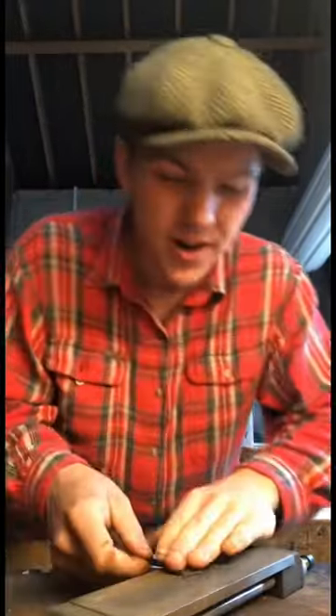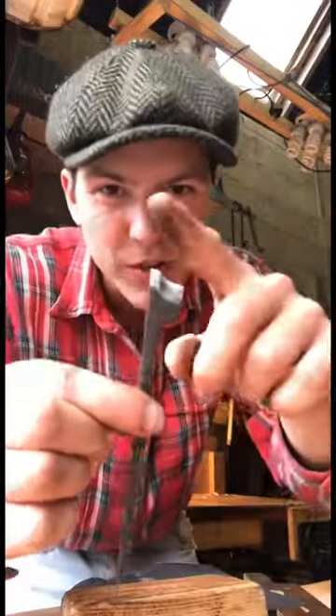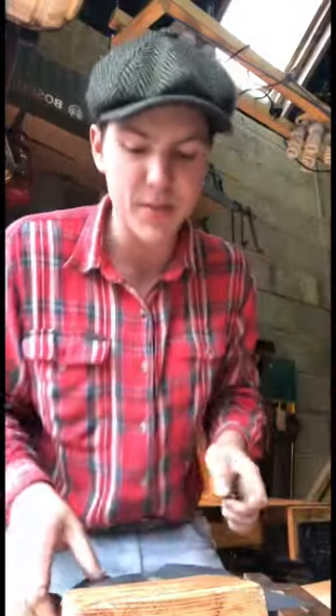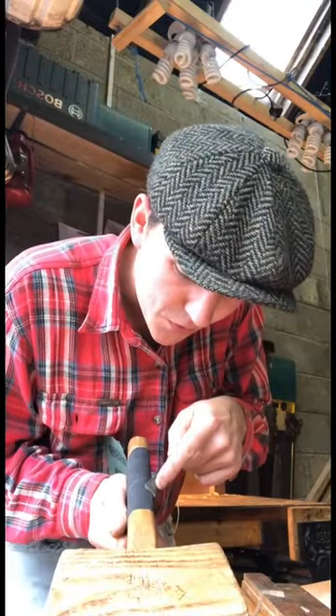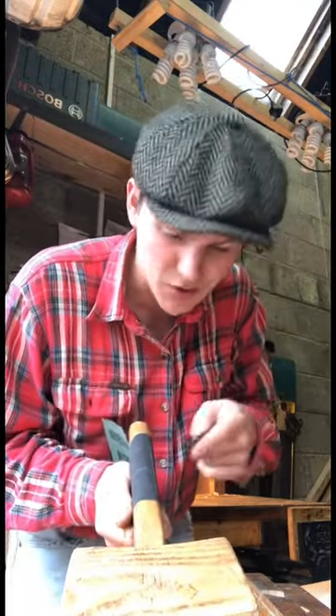Now for my own favourite part — we're going to flatten the back of this with the diamond stone here, just by rubbing it like this. Now to sharpen the front bevel, you might have noticed it's not flat. We can't just rub it against the diamond stone, so what we need to do is get a bit of high grit sandpaper, I have it wrapped around this curved handle of the mallet, and I'm just going to rub it up like that. And that's how I'm going to do my sharpening.